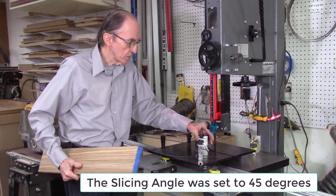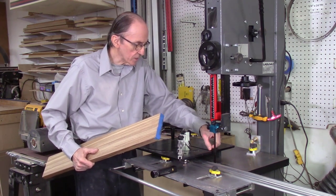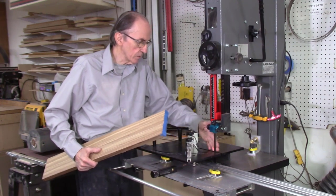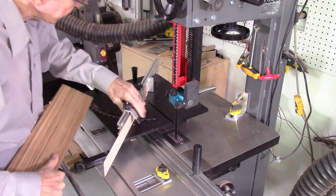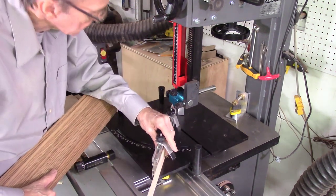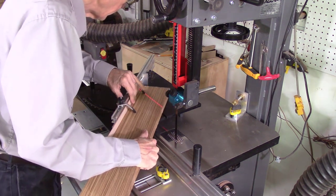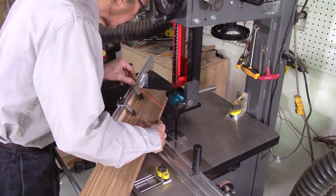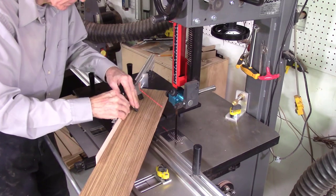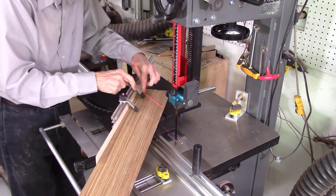I have it set up and aligned so my blade goes through the center of my board. I set the blade close to the outer edge of the slot so pieces won't get caught. I have my AccuSled all set up and cut the board so I can cut through without going into the fence. I'll do my initial cut to cut a 45-degree angle. I'm clamping my board down with two clamps so it doesn't move, allowing accurate cuts. I am also using a laser beam to show me exactly where I'm cutting so I don't cut into the clamp.